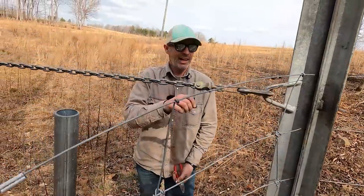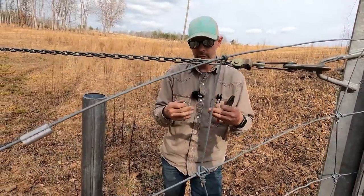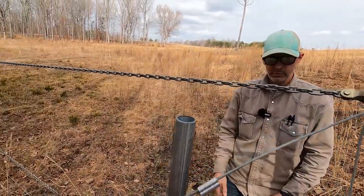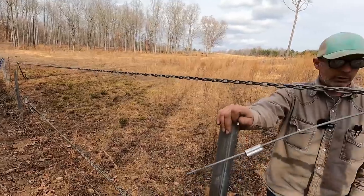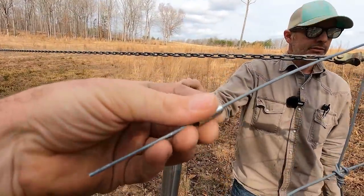You want to pull about half of that tension curve out or a little bit more, but then it leaves enough in there that gets you through the dips and dives that you find on a fence row over the crest of a hill. And you're able to do that without what we call a bias cut. So that's Tornado's claim to fame, is the lack of slack line wires.